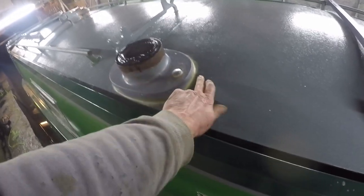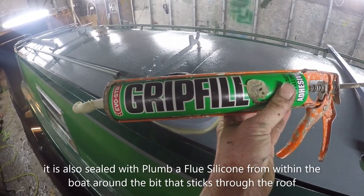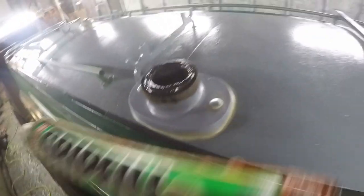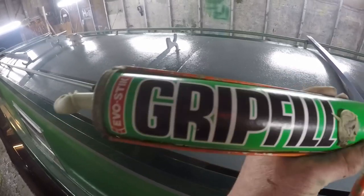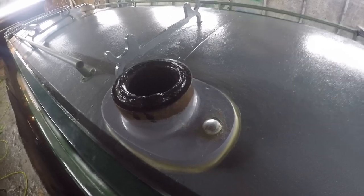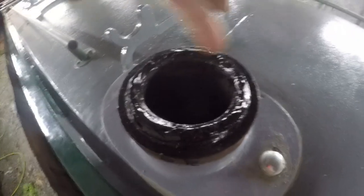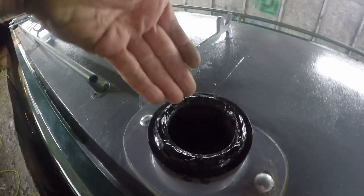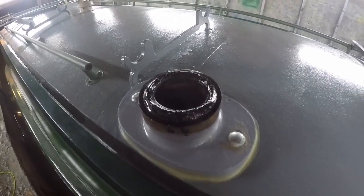Here we go then, I've sealed it up. I used some Evo-Stik Grip Fill to go around the edge there, just to take up that little tiny gap. I find this pretty good because it's over-paintable, it seems to stay a bit flexible and it sticks to absolutely anything forever. Once the grip fill's gone off, tomorrow I'll give it a coat of paint. I've done the silicone around the top here and wiped it around with my finger to create a little funnel effect, so if any oil, grease and stuff that forms inside the chimney runs down, it's got more of a chance of going back down inside the flue and being burnt and going up to the sky. That's how I do that.